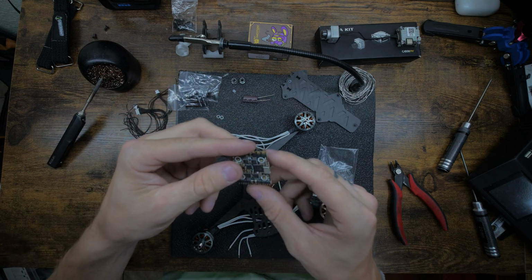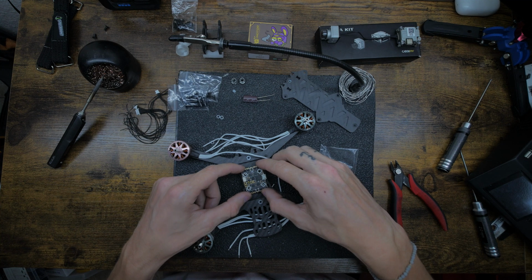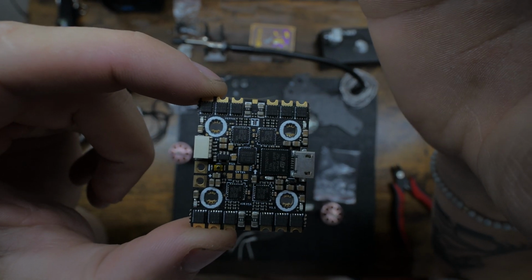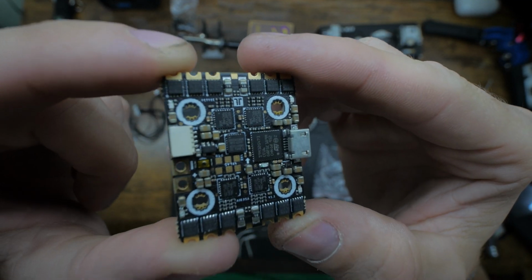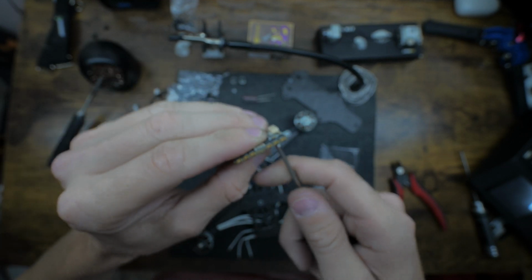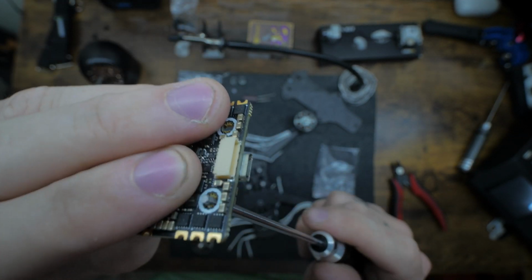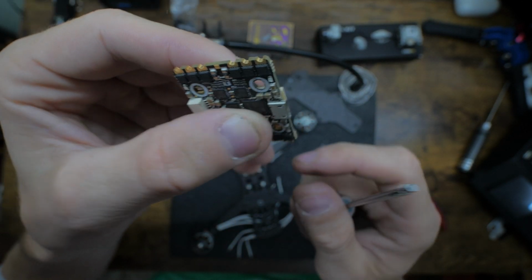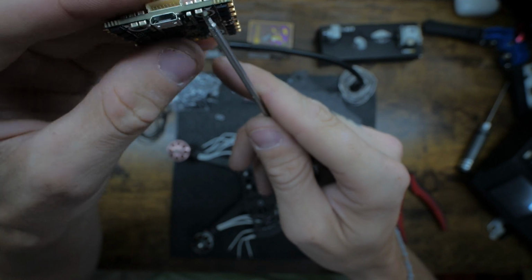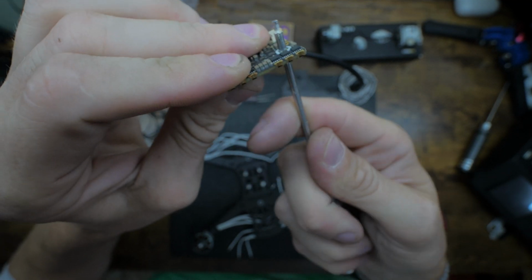we will take the all-in-one. Arrow still to the front. And if you look inside the flight controller, see those little tabs? That's if you wanted to use an M2, but we're using M3s, so we're going to just take something that could punch it out. I like using something like this tool, right here. So we want to just take a 2mm, and you can put the 2mm in there, and then just spin it around and push through, and that does it really nicely, because this outer one fits perfect, and that kind of eats it out and then goes to that. So that's a pretty safe way to do it. Put it in there, spin it, push through, boom, M3, and just repeat that on all 4.